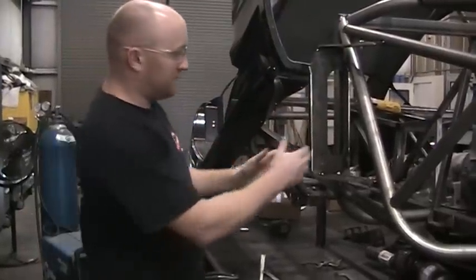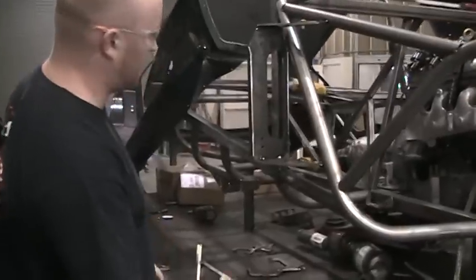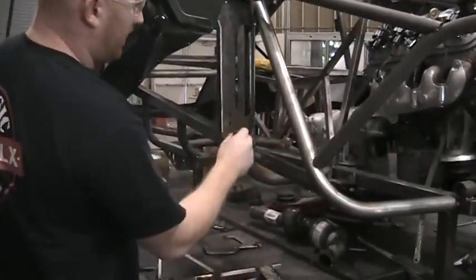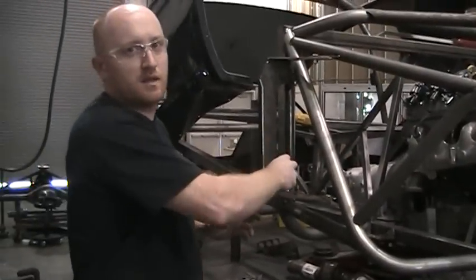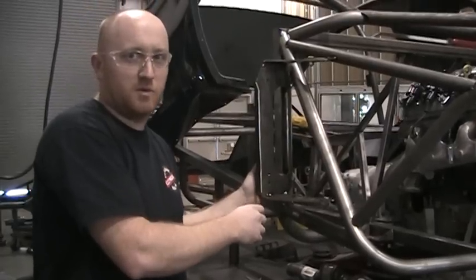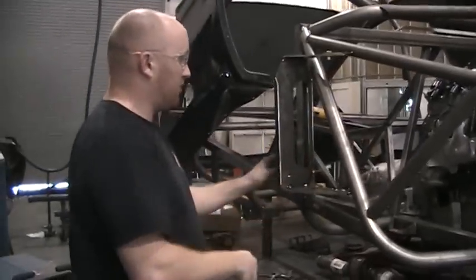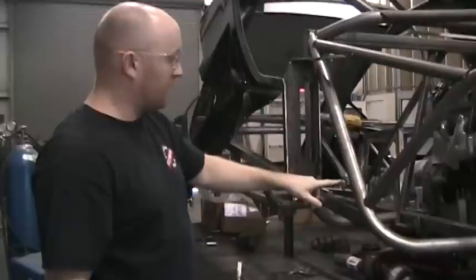So these pieces here were a little bit easier to bolt on than the previous design. Again, you're reaching in the wheel well and only have to access the one side of the bolt because it's a carriage bolt. But it was still kind of difficult to reach in there and access the bolt, to set the carriage bolt in, and then to put the nut on, whether it be the 2 tabs in the back here or the gussets on the top or the bottom.